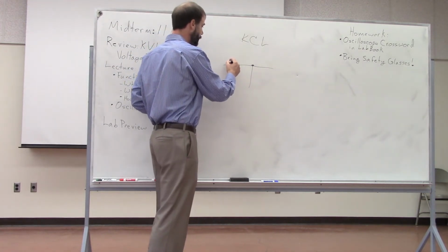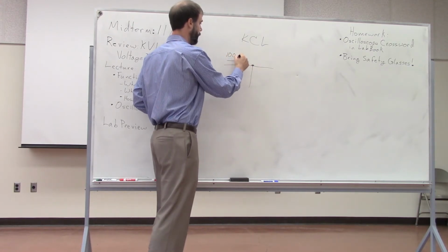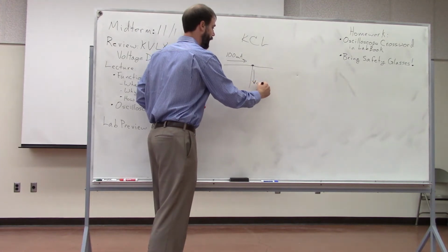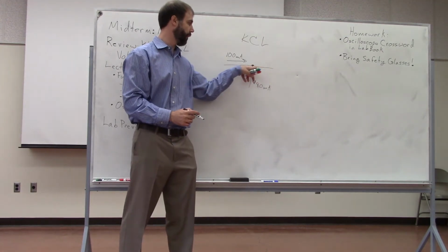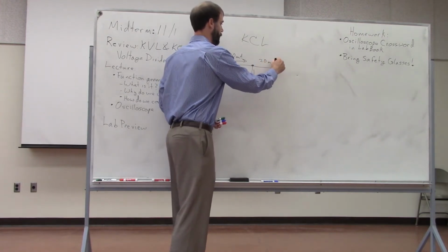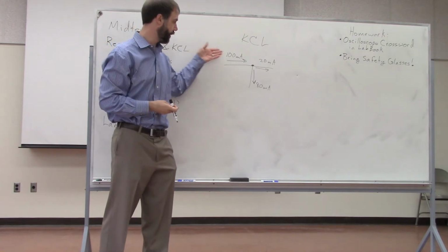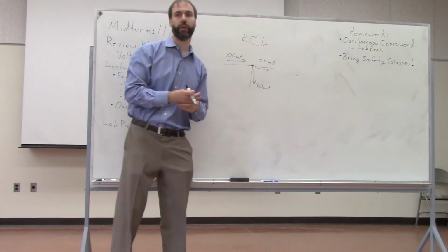So if we know that we have 100 milliamps going in there, and we have 80 milliamps coming out there, how much do we have in this? 20. Exactly. And are they flowing in or out? Out, exactly. So we know that we have a total of 100 going in, so we have to have a total of 100 going out.